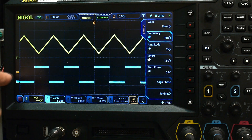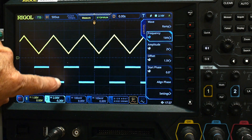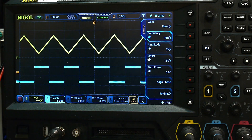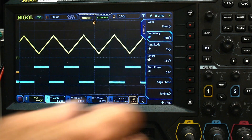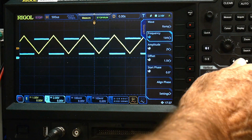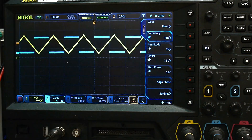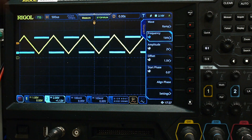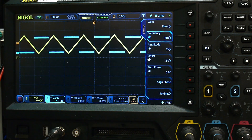It's an inverting thing also, so when it goes down to a certain amount it goes to the high state, and when it goes up to a certain amount it goes to the low state. Here's a trick with an oscilloscope: if you want to see where you're triggering, just move one of the traces up and you can see where you're firing. On the up you're firing right at that voltage, and on the down you're firing at that voltage.